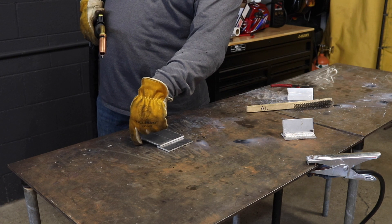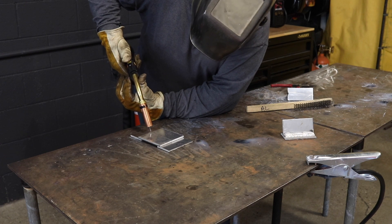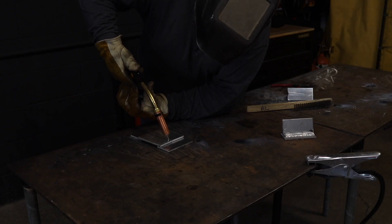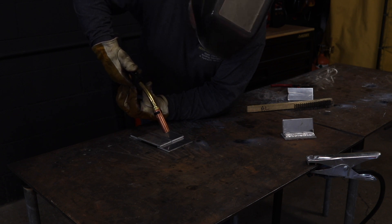The reason I do this is to have air under here so the workbench doesn't cool it. Normally at that material thickness, I either chamfer them or space them out a little bit. Here I'm going to give it like an eighth inch space out.